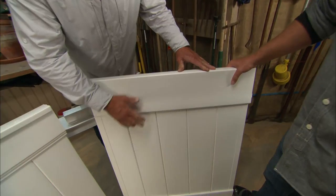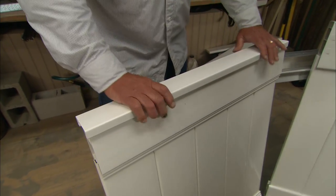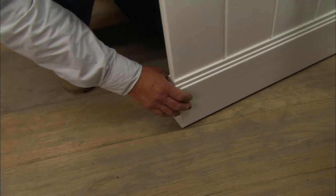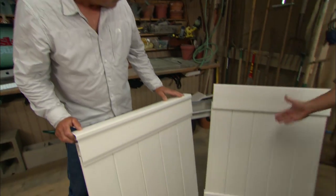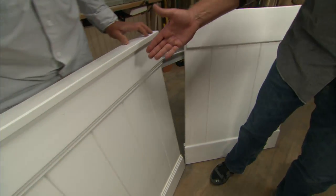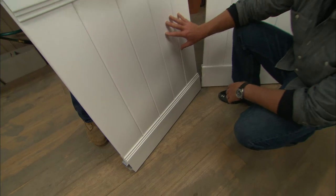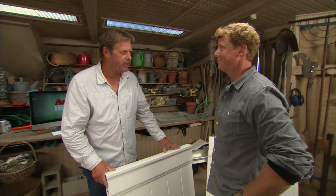Some people might say vinyl doesn't have the best reputation — that it might be flimsy. But all vinyl isn't equal. Take a look at this cheap one: just a top rail, bottom rail, and that's it holding the whole thing together. Now this is the vinyl fence we installed. You notice the top cap, which helps stiffen the top, but the most important part is the aluminum i-beam in the bottom rail — that's going to stop it from sagging or bowing. Every post also had a piece of pressure-treated six-by-six in it. The top cap and molding detail are nice touches too, and you're never going to have to paint it. Buy the right vinyl fence and it should last a long time.